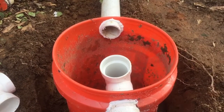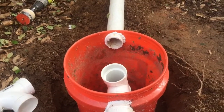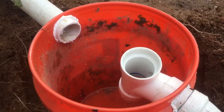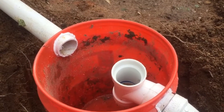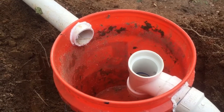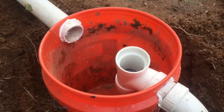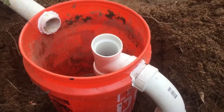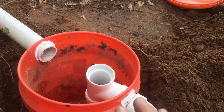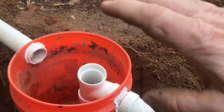What you are looking at is a homemade grease trap made out of a five-gallon bucket from Home Depot. This is a grease trap that you can install for a kitchen sink on a retreat property, a bug-out location, your vacation home, a cabin in the woods, a hunting cabin, a mother-in-law suite, or if you're turning a garage into a little apartment. The only reason you would need this is because you have a gray water system — not black water — a gray water system that releases on top of the ground.